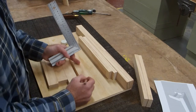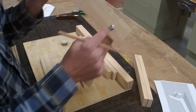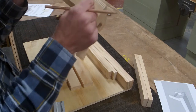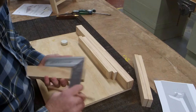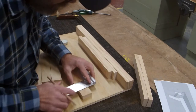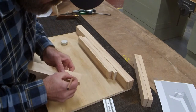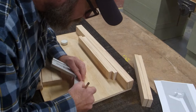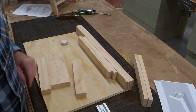While I'm here, we're going to mark the hole in our leg for our nuts and bolts. These are 42 wide, so I'm going to find my halfway — 21. I'm going to come in 21, down 21. So that's our centre. And this is my 21.